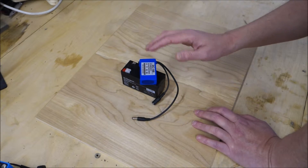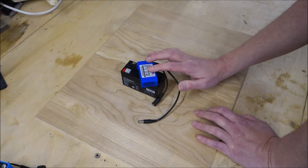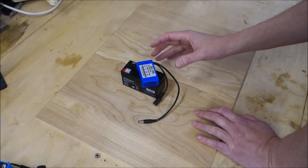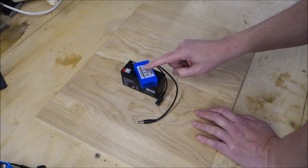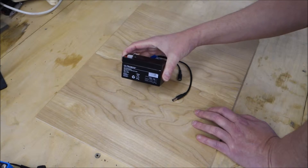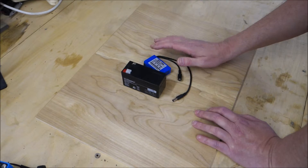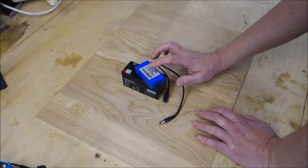The way to get around this with lithium polymer batteries is that this type has built-in overload and overcharge protection. In practice, this means you can't overcharge the battery — you can't put too much power in while charging, so it won't overheat while charging. More importantly, you can't draw too much current from it. For example, although this is a 1.2 amp hour rated battery, I could plug it into a smoke generator and try to draw 10 amps — but with a LiPo, if you try to plug in something too powerful, the battery will just switch itself off.